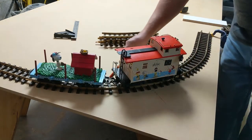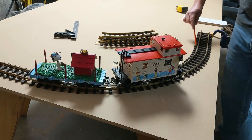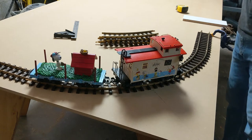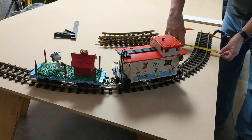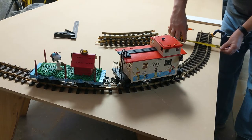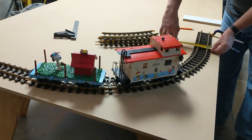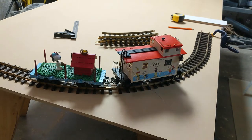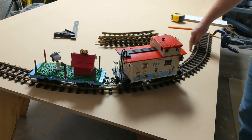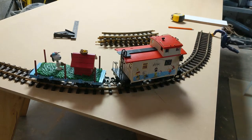I'm going to score the inside of the track at two inches, and that gives me about five and a half inches, because the track is three and a half inches wide. So an extra half inch past that — that's what I wanted to get to — six-inch shelves. So that puts it right on the outer edge of the shelves. I could go with eight-inch shelves, but maybe I'll do a lip.